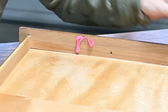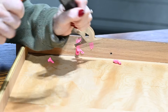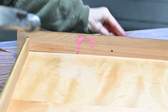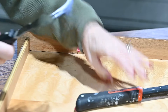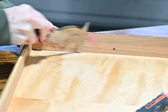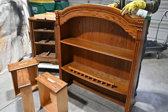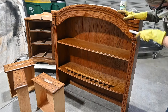I think it's like that slime stuff or foam stuff — whatever it is, I needed to get it off. I used my painter's tool and just chipped that off, then I'll sand it smooth and you'll never know it was there. Now I'm using Pure Power from Farmhouse Paint — it's a pre-paint cleaner degreaser that gets rid of wax and dirt and just works really well.